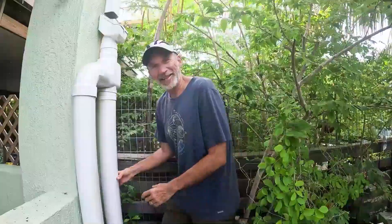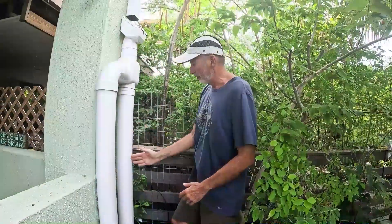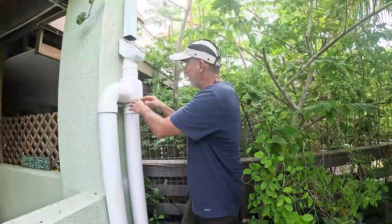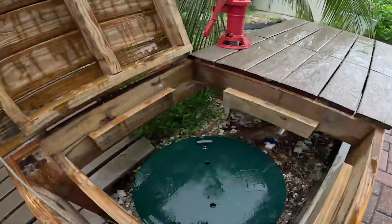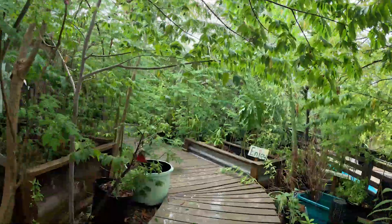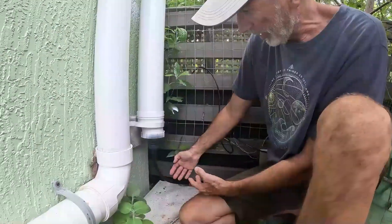There's a plastic ball inside this tube. As the water comes down off the gutter, it'll go through here first. That ball floats up on the inside until the water gets up to the top, and then it seals it off, and then the water gets diverted automatically to go down to our underground tank. You might wonder what happens to that first five gallons — well, it gets put to good use. It actually gets diverted out to the garden, so it trickles down through this hose.